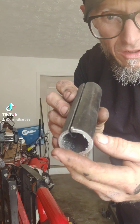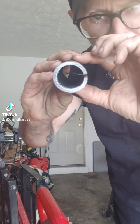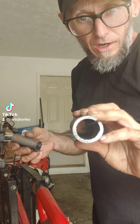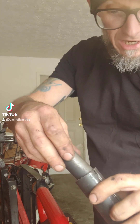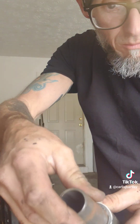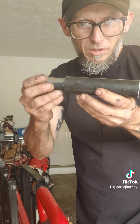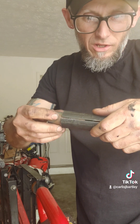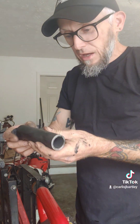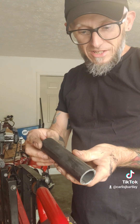See what we've done here — I cut that slit in so I can put tabs on here with bolts going down, and that will allow it to clamp down on the tubing. Again, this is one-inch black iron pipe, but as you can see this one-inch tubing is thin wall — that's not what I'm using for the bars, but it's a pretty tight fit. I can slide my bars in from the top, tighten those down, and it clamps. That's how the old Harley risers worked.